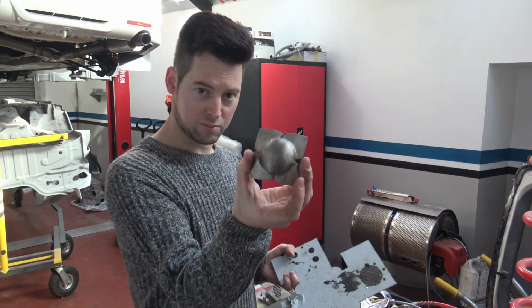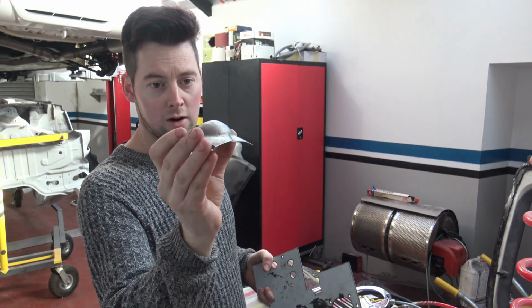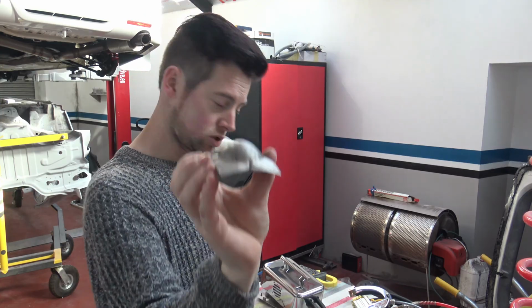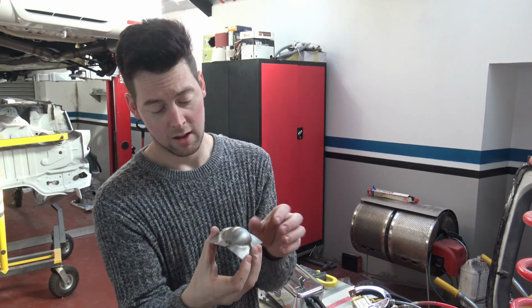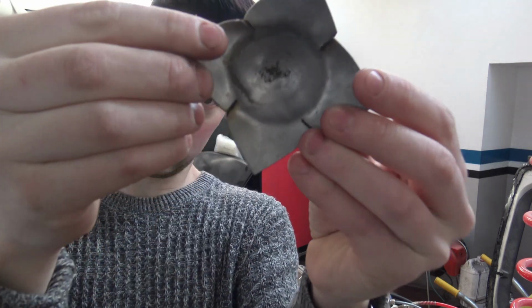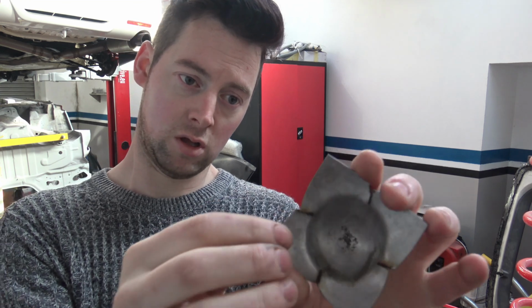So basically this is pushed over, as you can see there's a bit of greasing inside it, because I put grease over the tow bar, a 50mm ball really, and I pushed this over using a press and a ring, a 3-inch ring. So it's about a flat steel, there's no heat, and it's been specifically cut in triangles here, as you can see. See the wee slices? Them slices is crucial to get that ball nice and round.